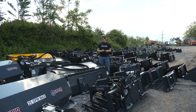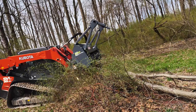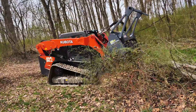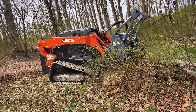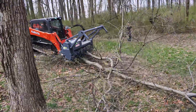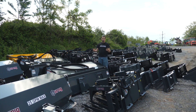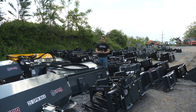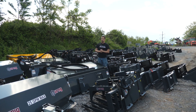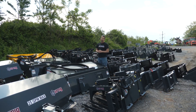Keep that in mind when we're talking small tractors. On bigger equipment — when we start to talk things like Kubota's SVL 95, a 95 horsepower big heavy track loader with high horsepower hydraulics, high flow running at high PSI — the horsepower game starts to look a little bit different. In that machine, we have a 3,500 PSI hydraulic system running at 40 gallons per minute, able to deliver 83 of that machine's 95 horsepower as hydraulic horsepower to run things like asphalt planers and Harley rakes and other demanding hydraulic implements. Keep that in mind when putting implements on your machine, and remember that shafts are always going to run things more efficiently than hydraulics when it comes to delivering engine horsepower.